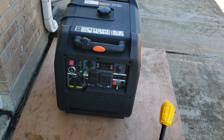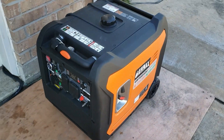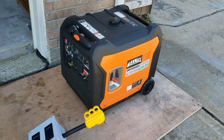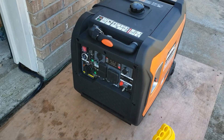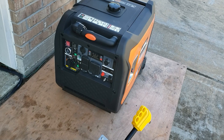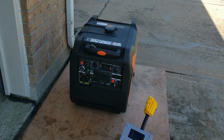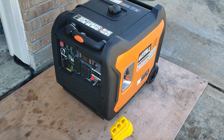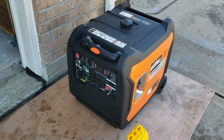If you're looking to buy this 7250, it's highly recommended — it starts the load, runs the AC, runs ceiling fans, runs the refrigerator. But I would recommend going to a 9,000-watt if you want to run a 5-ton AC as a whole-home backup. If you just want to run your home backup on lighter loads — refrigerator, window unit, stuff like that — thumbs up to it. Awesome generator. I love all the features: gauges, remote start, dual fuel, push start, 50-amp plug, parallel capable. Thanks for watching — please give me a thumbs up, smash that subscribe button, and have a great day!